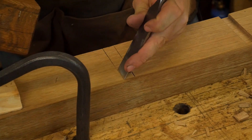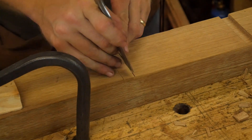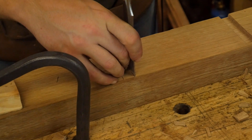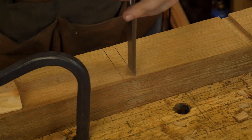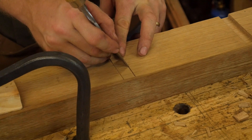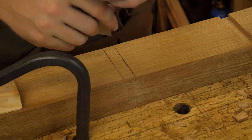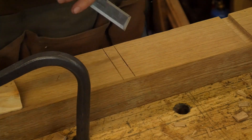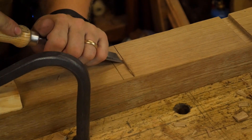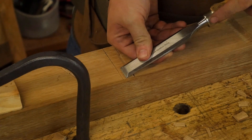Do it on the other side. As I moved it, that moved the material over towards the marking gauge line. Now that I've cleared that out, I'm going to break from tradition a little bit and go right into that marking gauge line and give it another tap right here. That will define the edge of that line. So now that I have that line defined, I can basically do the same thing all the way back along the side and continue along. Now that I've made a stop cut on either side all the way along, I'm going to come back in with a chisel and just pare out the waste. I'll come back and do that from both sides, which will allow me to then cut down a little farther.